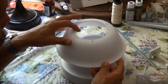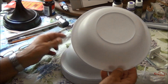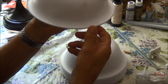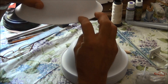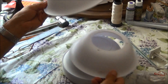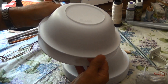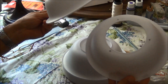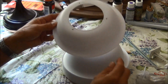The other thing is when it rains, I don't want an edge that will hold water. This bowl has a little lip and most plastic bowls have a lip, so if it rains there's gonna be a puddle of water all the way around. So I'm going to cut that lip off so the rain will just fall off. On the top bowl there's also a lip that I'm going to cut off so it won't hold a puddle of water up there, which would also affect the humidity reading.